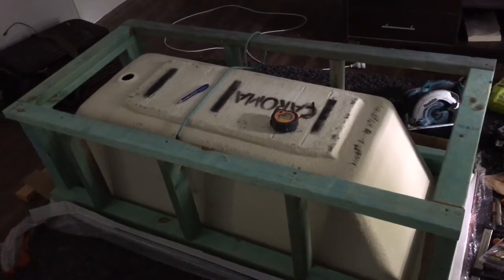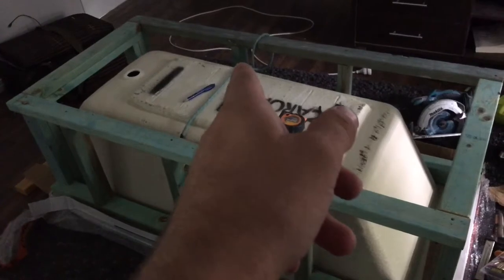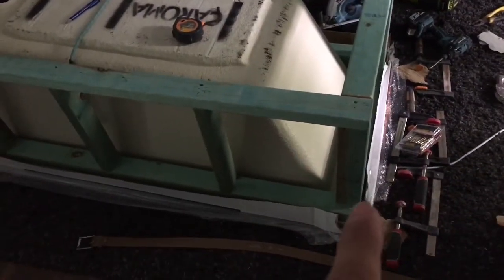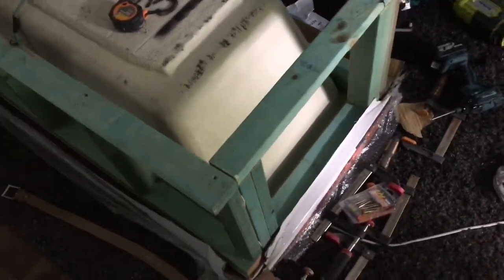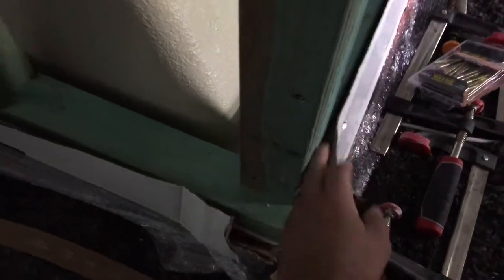You can see there it's all spaced 450mm — that one there is 460, so I need to flip that one around. Before 450, when I'm happy with it, I'll do a test fit and then I'll fill in these spots. There's an extra stud there, and one on each corner. It's going to sit in the wall a little bit; there'll be fiber cement sheet to space it out, then I'll screw through that into the wall, and it'll be screwed down to the tongue and groove floor.